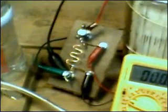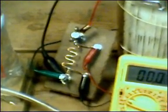Right here I have my poor man's DC amp meter shunt. It is 1 millivolt per amp, so for every amp there is 1 one-thousandth of a voltage drop. It's very, very small, so it doesn't end up impacting the overall voltage that reaches the terminals on the top of the cell.